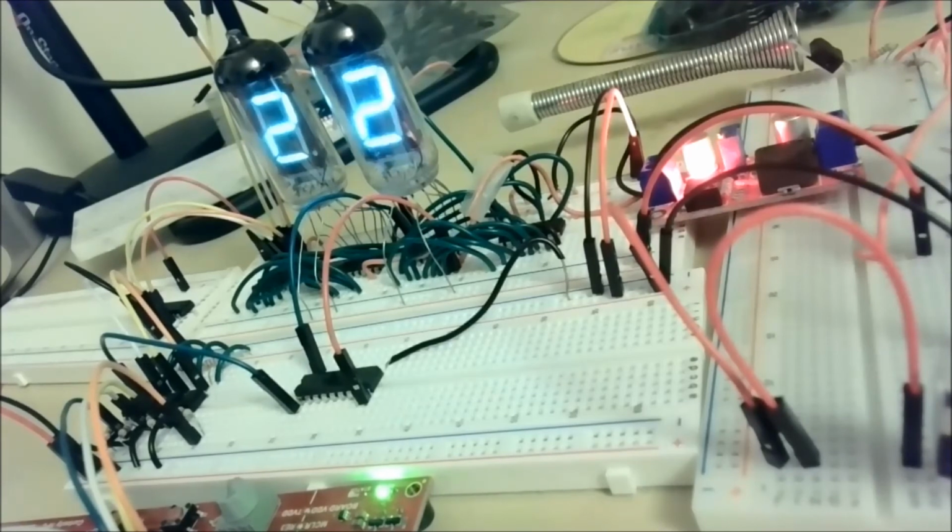And basically the way these boost and buck regulators work is they have an oscillator in there, and you're doing switching. In a simple way, I'm more familiar with it like a charge pump. You have a capacitor and a charge pump inside a PLL. If you want to up the voltage, you go in one direction, you apply some voltage, which adds some current, which increases the charge on the capacitor a little bit. And if you want to lower the voltage, you connect a resistor for a short period of time to drain a little bit of charge. The frequency of the oscillator is proportional to the voltage. So you can have control circuits that are constantly switching, going up and down, until they get to an equilibrium where there are equal numbers of up and down.